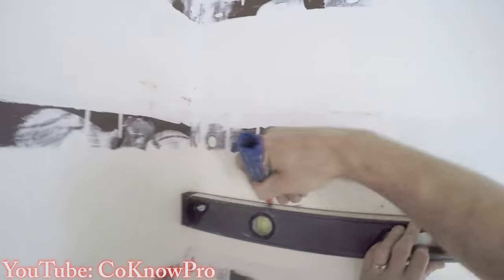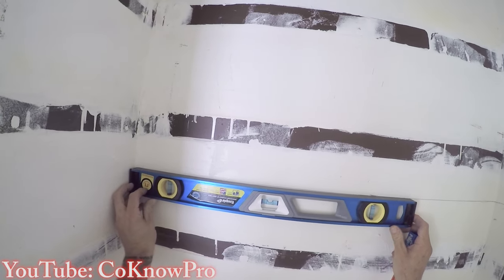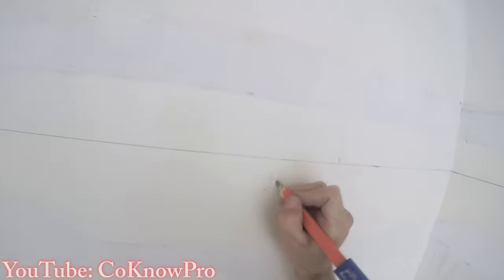I start from one side and level over to the other side of the wall. I take my two-foot level to level up my left side — that's going to be my left side ledger to receive the left side of my closet shelf and pole. Now what we're doing is measuring from wall to wall to get our measurement. Once we have it we'll write it down, then we'll double check for our studs.